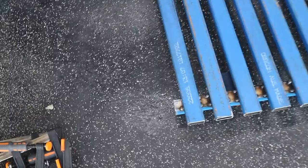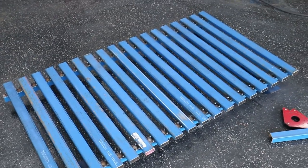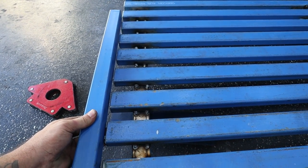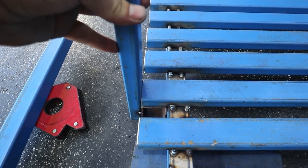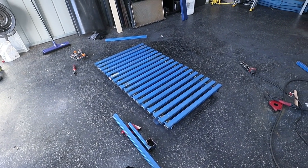That is the top made, but I overshot by the thickness of my spacer - I just miscalculated that. Not going to lie, I did make a huge mistake. My saw doesn't cut this properly and I was using it as a straight edge, but it just wasn't working - it was going in a little bit, so my slats were going slightly off. What I did is quickly made a jig that goes under and allows me to keep that 50mm gap and square it off the actual frame, not using my wonky cuts. It set me back a couple of hours, but we're going to keep going. I'll flip this over and start measuring for the legs.